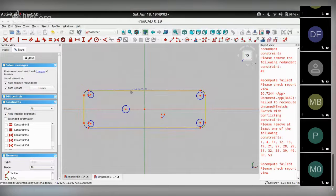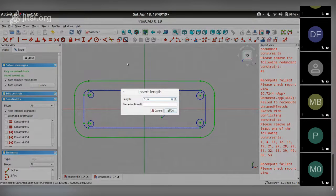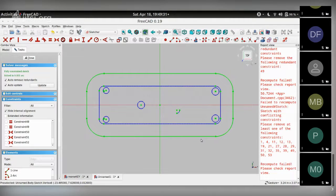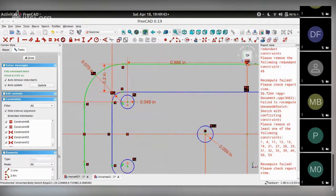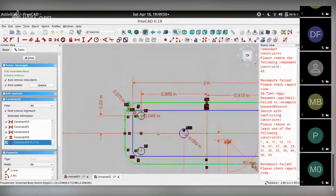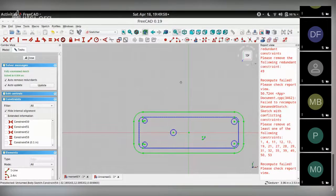It's going to follow the outline of my PCB. I just need to choose how thick I want it to be. So that's this gap between these two points, this linear vertical distance. Let's say 0.1 inch is about 3 mm, so 0.2 inches. So that's going to be the outline of the enclosure that I'm going to build for this device. Actually, 0.1 might be a bit too much. We don't need it to be that thick. So let's go down to constraints, select 0.2 and make it 0.1. 3 mm is plenty thick for 3D printing, so should be okay. Good for this. Here it is.